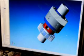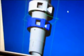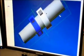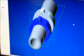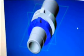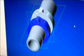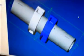The sealing, if we go over to this image over here, on these stators in the centre, we'll be putting initially a high temperature Teflon seal around the outside, and then one across the tip here. Later on we can do that in ceramics if necessary, but that's what we'll be using initially, the Teflon. And these are twin stators with two lobes. We can have 3 lobes if we choose, which increases the flow, but at the moment this pump should put out about 1 gallon US per rev. And it'll be doing 125 revs a minute at full capacity, so it's putting out 125 gallons a minute.